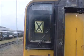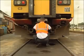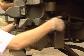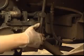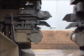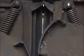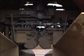If your train requires you to couple to a unit which has a known electrical fault, it'll be necessary to place both of the electrical connection blocks in the retracted position. To do this, unclip the two tommy bars — one on each side of the coupler — and pull them down towards you until they are vertical. Be careful not to trap your fingers or thumb, particularly on the right-hand bar. Once the electrical connection block is retracted, the units can be coupled mechanically without the danger that the electrical fault will be passed to the good unit. When coupling has taken place, you should be able to see daylight between the adjacent electrical connection blocks. Don't press the couple button when you return to the cab. In this condition, your train may only run at a maximum of 5 miles per hour to clear the main line.